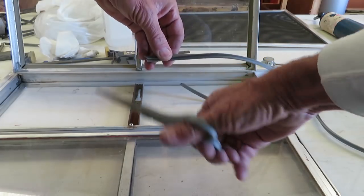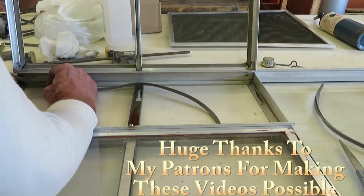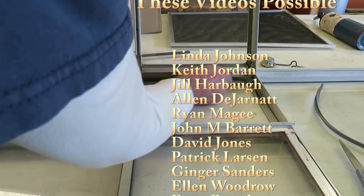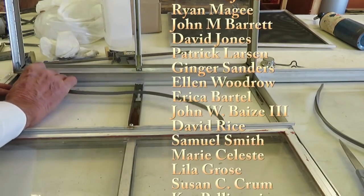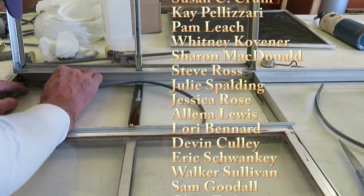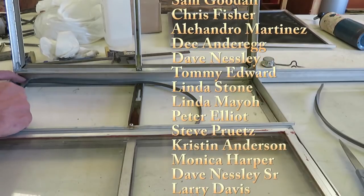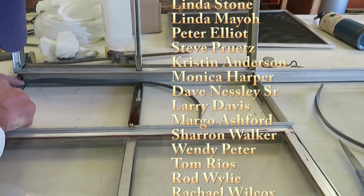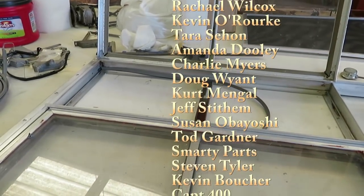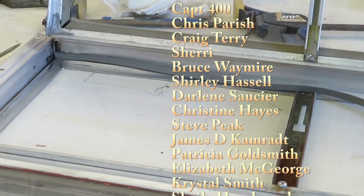Hold it in the position it's going to be in, cut at a 45 degree angle, and then check your fit before you put it in the notch. If it's a little too short, that's okay — what you don't want is for it to be too long. Now just poke it in there and shove it down. If needed, push it down with a screwdriver into the notch. I'll zoom in so you can see — just pushing it down with a screwdriver into the notch, moving over the width of the screwdriver each time until you get it all in there.